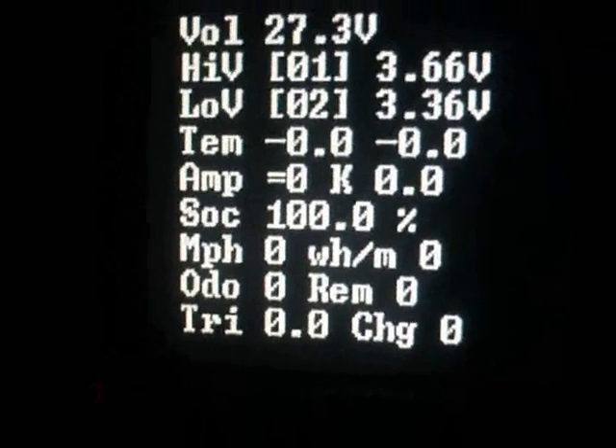There are quite a lot of features in this little thing. At the moment we are on constant cutback on our charger, and that shunting LED is on permanently. I've just throttled my power supply back to just under 250 milliamps, which should be just below the shunting current. That will be something I have to set up on the pack charger. More to follow when we get some more cells happening.